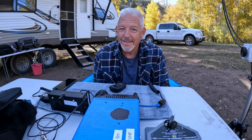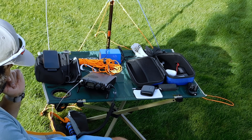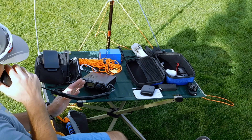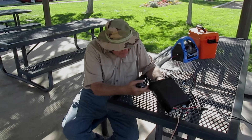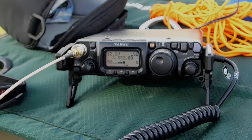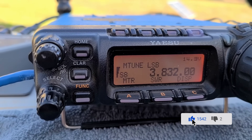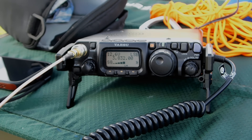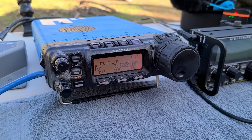This is pretty cool — you faded out right when you were giving your name and call sign, then came right back up. I think this has been a good test to see how NVIS works at this time of day. I faded out — I'm running 5 watts. You are not fading at all, zero fade. Just 5 watts jumping over the mountains to talk to Heber is pretty neat. If the repeater system ever goes down, we have another option for local communication.